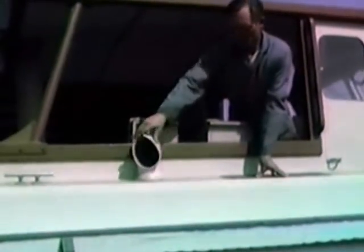That's the engine air intake? Right, engine air intake. And the exhaust for the engine goes up the hot stack. It has a 6-inch aluminum pipe, so that it also acts as a vent for the engine compartment. Okay. And this can be turned, if you're proceeding at a fair clip, you can rotate this forward to get better ventilation of the engine.